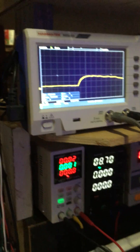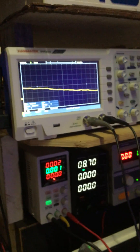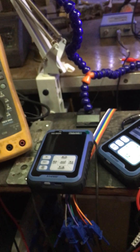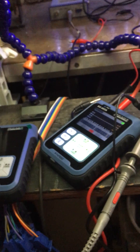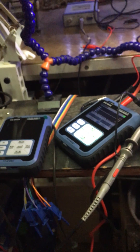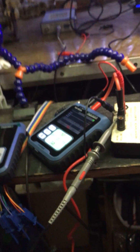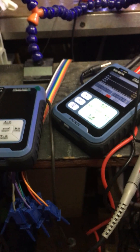It's no big deal once you're aware of it. It's actually remarkable given that this is a digital control device. I was considering building one out of an LM334Z, which is an analog current source that can go down to one microamp, and I might mess with that at some point to compare them. But this isn't bad — using sensors and stuff is the reason I bought this thing. I don't know anything about process meters or PID controllers.